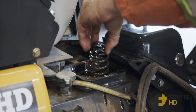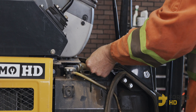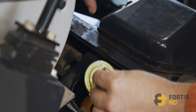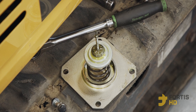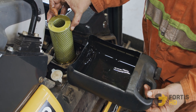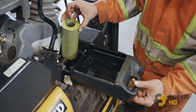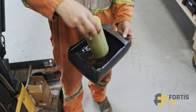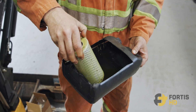Next, you're going to pull the spring off — I like to put it on the lid. And the next thing you have in here is what they call a bypass; it sits on top of the filter and this is what the spring holds down. I like to let it drip off a little bit and put it on top of the spring so I know how it goes back in. Take the drain pan and hold it close just in case it starts spilling. The filter just sits in there — it doesn't screw in — so you can just grab it and lift. Let it drain. This is the hydraulic filter that came out of the machine. I usually give it a quick look for any pieces of seal or debris. It looks pretty clean. We highly recommend you sample your hydraulic oil — for a video on how to do that and read the results, check the link below.